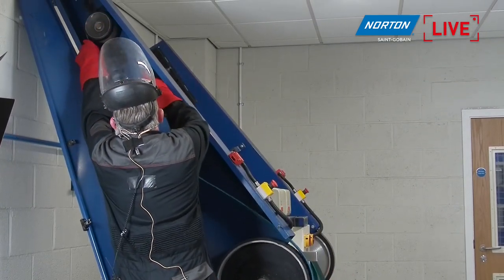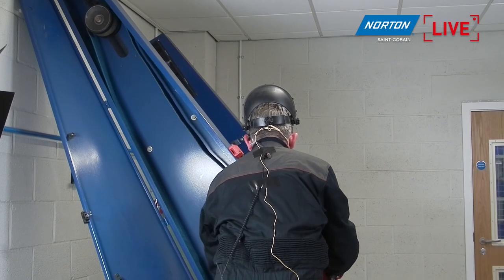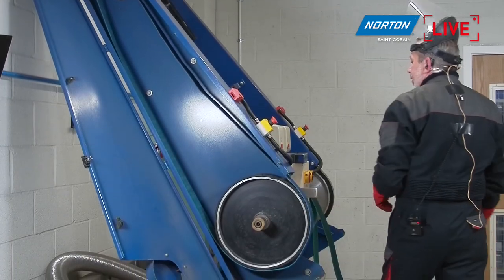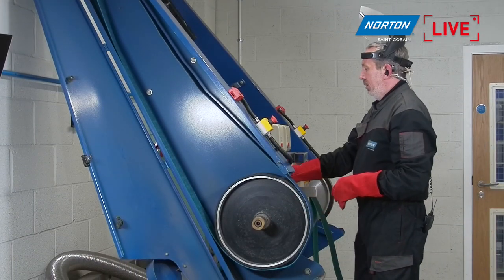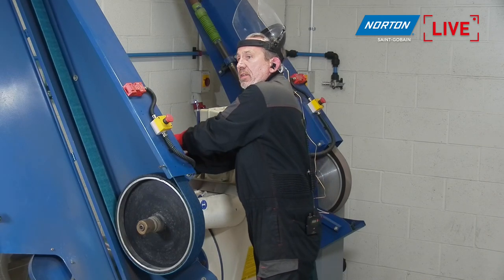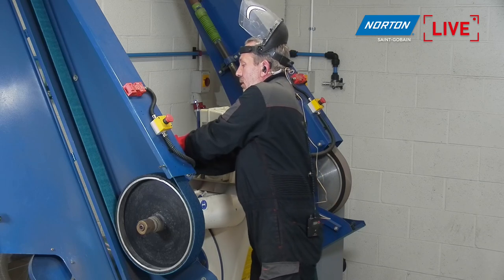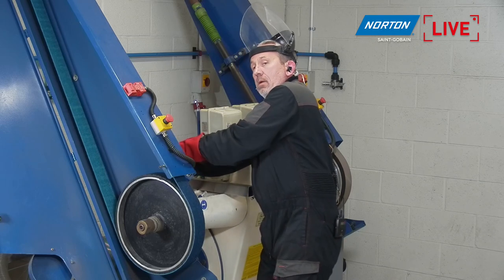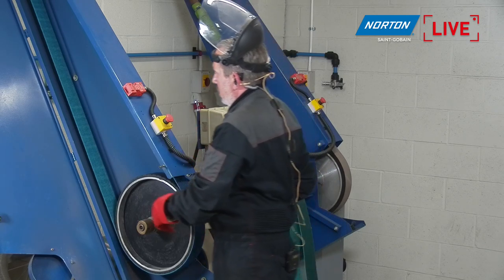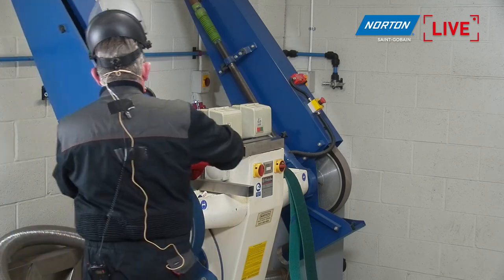Sorry, Robin, what was that? I was just asking Paul an open question. Where would you say we are in terms of Ra level after that last step? After the medium grade, I'd say we're around about 0.6 to 0.7. You can see the progress that we're getting from what Paul showed in the slides earlier on, in terms of some of the finish levels that are required in industry.